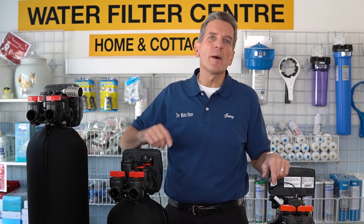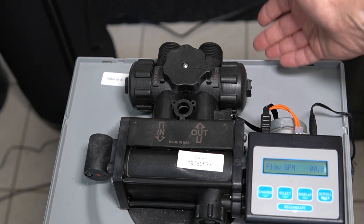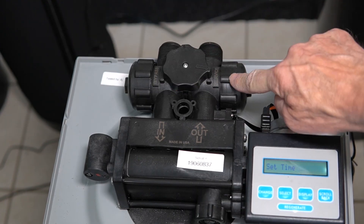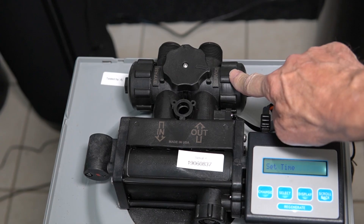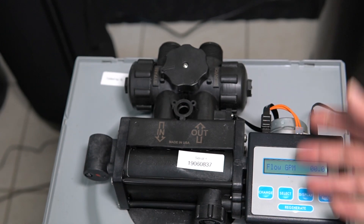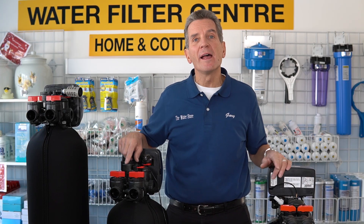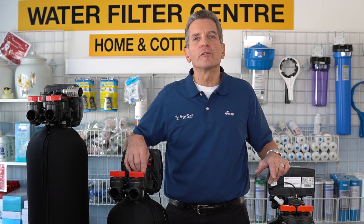If there was a leak or something just wasn't right, bypassing shuts off the water flow so you can go back to bed and not worry about it. Aquamaster or Water Boss water softeners are easy to bypass — you just pop off the lid, and here is the bypass valve. Right now it's in service, as shown by this arrow. You just turn it over to bypass, and now no water will pass through the water softener. For older installations that don't have a built-in bypass, they have a three-way plumbing bypass built around them — I have another video linked in the description that explains that whole process.